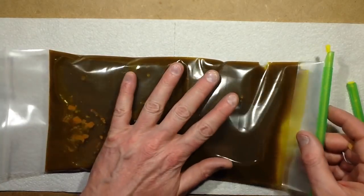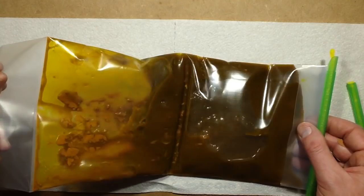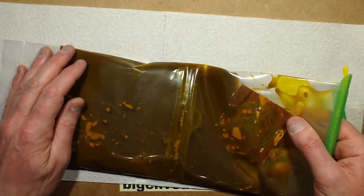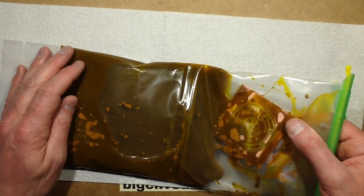This is ferric chloride in here, and this is going to take a while, but the first thing I want to do is check. I want to get the circuit board up to one end. I'm getting a lot of copper settling out of this in here by the look of it. I want to check that it is all developing. I think it is all etching okay.